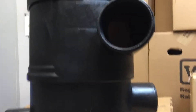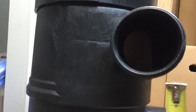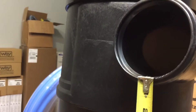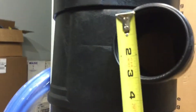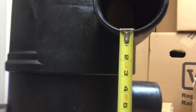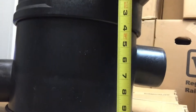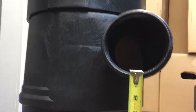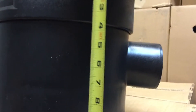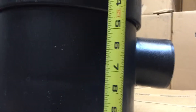Now, it's very important that you account for this switch in elevation — the pipe elevation here. The downspout water is coming in to this top fitting. If you'll notice, it's actually 7½ inches from the invert level of this top fitting to the invert level of this middle fitting — a 7½ inch drop in your pipe.